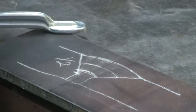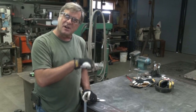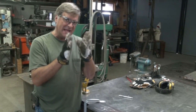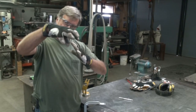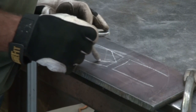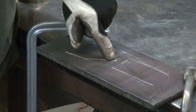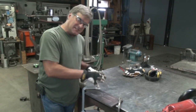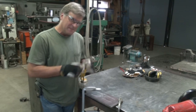Then you come in with your cap on top to fill it all back in. As far as I'm concerned, starting at about a quarter of an inch, I'll start doing this. Not quite half the thickness of your metal, because you want a little flat spot in there for the two pieces that bump up against one another. You want that bevel on both sides to get a nice joint with lots of penetration. If you took off half on top and half on the bottom, you wind up with a point — a really tiny thin edge you're going to blow right through when you start welding because you're running a bunch of amperage on thick plate. So I like to leave that little center section so you've got a little bit of meat to get into and work it up from there.